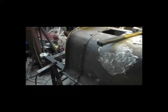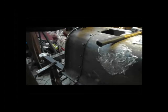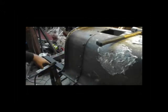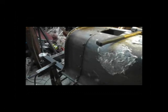I've turned the stove this way up so that I can do what would have been vertical welds in the horizontal position. All of these welds are far better done flat. Do everything flat, and that's what I meant earlier on by lying down. I meant flat.